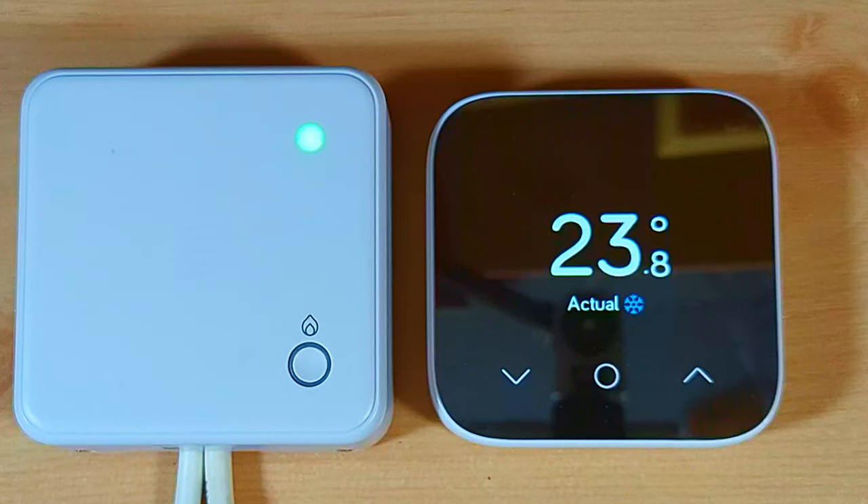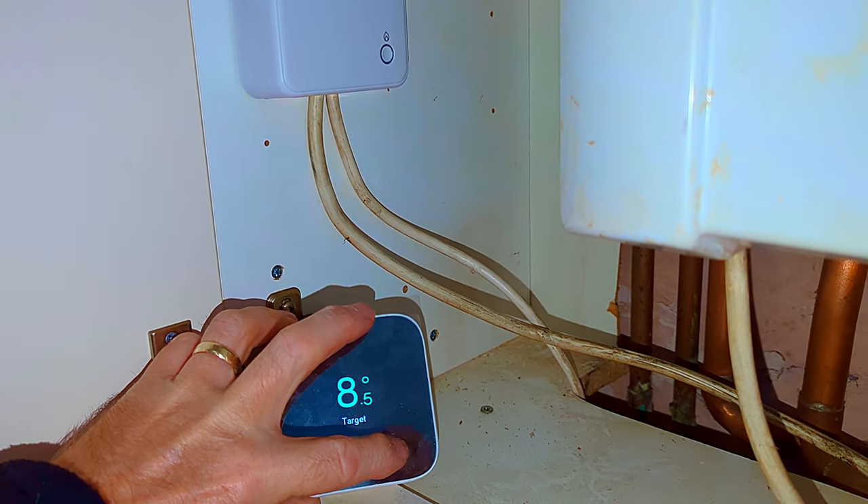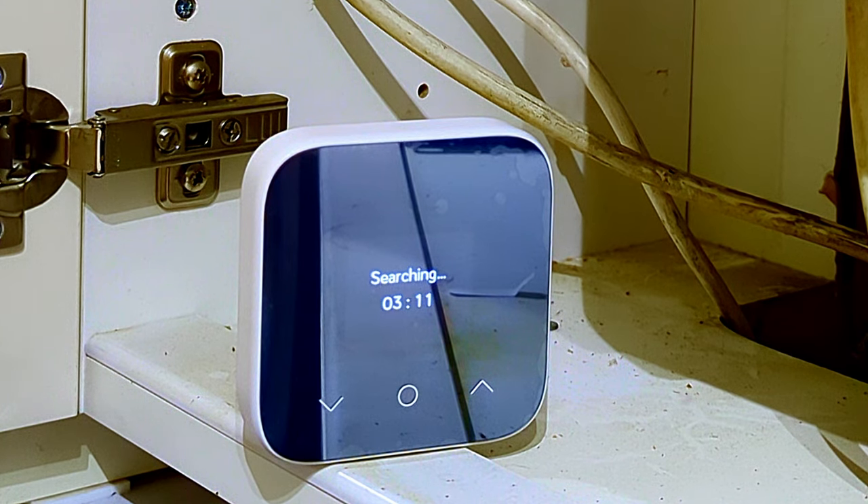Job done. We can now turn our boiler on and off from the room thermostat — no hub, no Wi-Fi setup, no smartphone. It's now going to work as a basic thermostat. Now if you're having trouble getting the two units to connect — and I certainly did with this one here; you can see it's been searching for three minutes, and it was still searching at about 15 minutes before I gave up. I tried restarting the process a couple of times but it still wouldn't connect. If you're having that problem, all you need to do is a factory reset on the room thermostat.